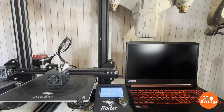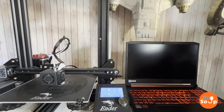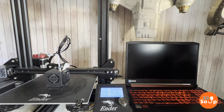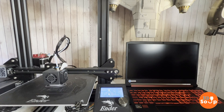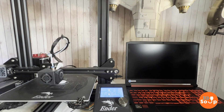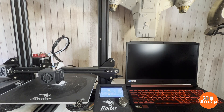While we're doing a quick time lapse, just a quick note on housekeeping. This 3D printer had been in my garage for about six months. I've got a couple of Ender 3 Pros, an Ender 3 Pro Max and the new S1, the latest version of the Ender 3. So it was a bit grubby after being in storage through a UK summer hitting 28 degrees. Took it out of storage, gave it a quick oil, greased the axes, made sure all the belts were tight, the bed was levelled and it was dusted off - and it came up lovely. So if you take your printer out of storage, give it a good clean, good bed level, re-lubricate it, and make sure your belts are tight.